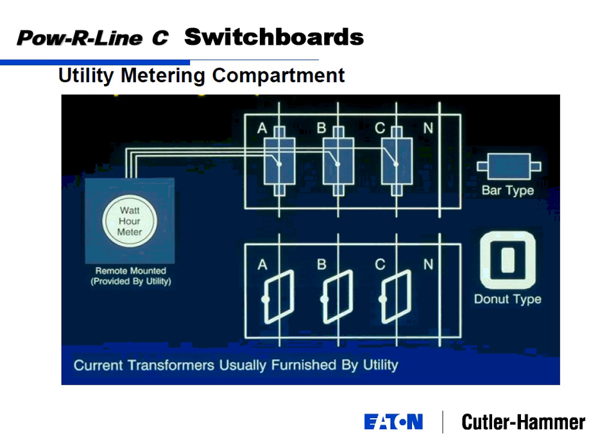Here's just a little bit better picture. They tap off, maybe not in the switchboard now, but say this is outside in a metering box. They'll put their CTs in and there'll be two wires off each CT, and that'll go to their meter, which is how they figure out how much to charge people. And here's the other type with the donut type.